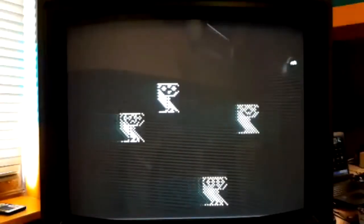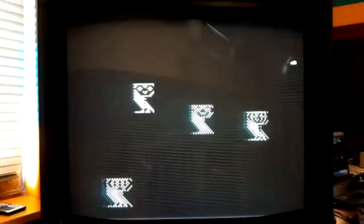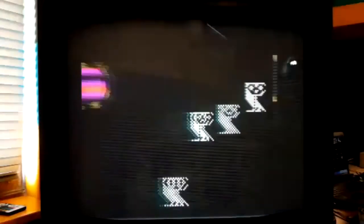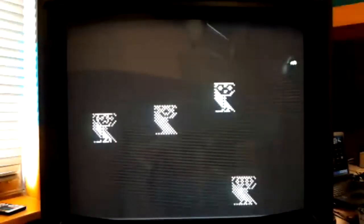As you can see here, it's doing some blitting to get the big writing on the screen and the owls flying past. But then, halfway along the line, and on different lines, it's changing the palette. So it's poking stuff into the palette registers at the start of a line, in the middle of the line, and again at another position in the middle of the line, to get the colors changing. You can see the rainbow background, that's just one color, and the palette's been poked about in the background.